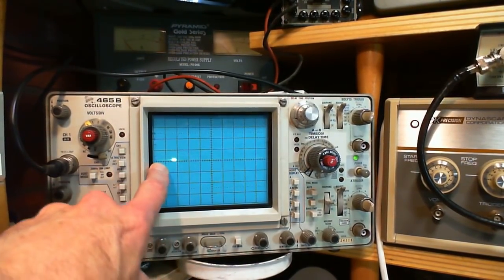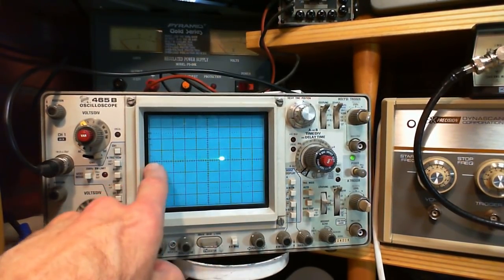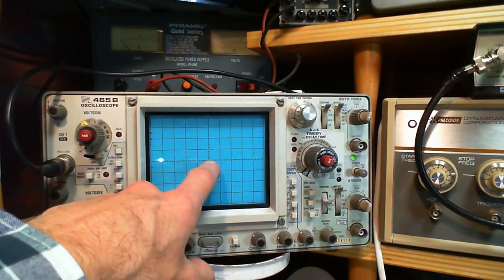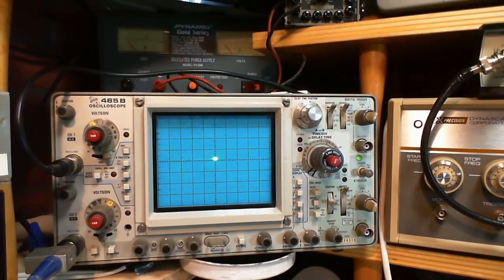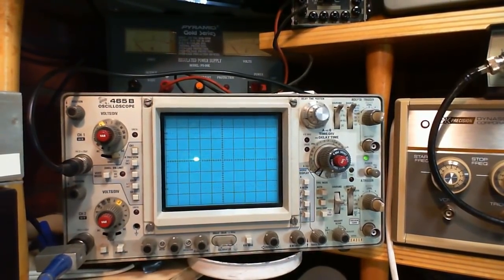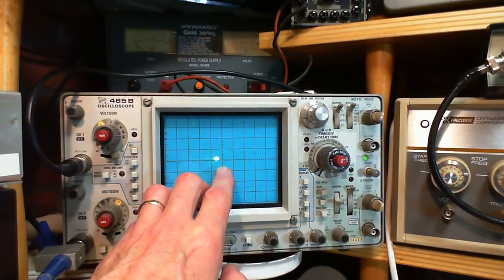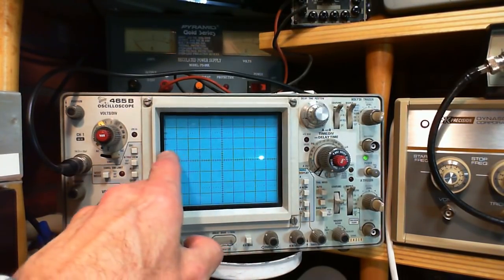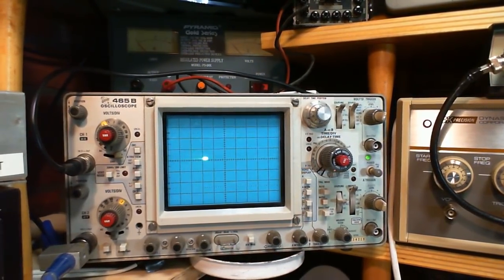So at this point where the dot is appearing right here, this would be the low frequency. And where it's disappearing, this is the top frequency. So 400 kilohertz, 500 kilohertz, 450 in the middle. 450 is roughly the tuned frequency of an IF. Sometimes they're 460. There's a few other frequencies in there. Some old radios might be as low as 260, stuff like that. But 455 is probably correct 80 or 90% of the time. So we would think if an IF coil is resonant at 455, right about here, then we would like to see some kind of a display like this. So that's what we're going to try to get going here.